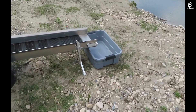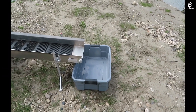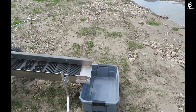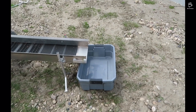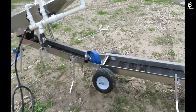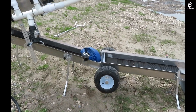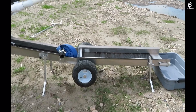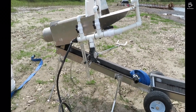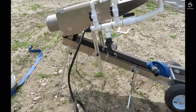Where I live we have to catch the suspended solids. Regulation asks us to put a catch basin here, catch the solids, and then when it's full just pull it to the side and dump it — they just don't want the suspended solids to run back into the water. With the center about a foot off the ground, the wheels are off the ground and don't interfere with the operation when you're running. So I'll hook up the hose, get the pump going, and show you all how this works.